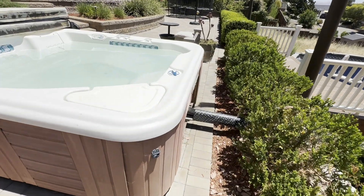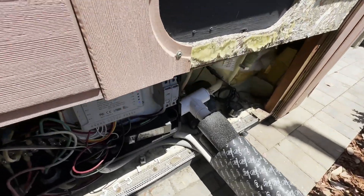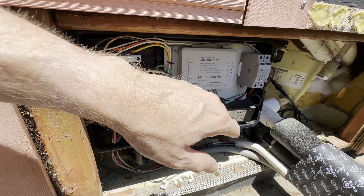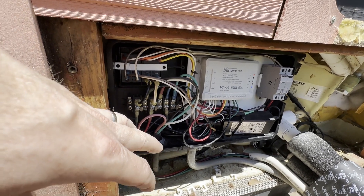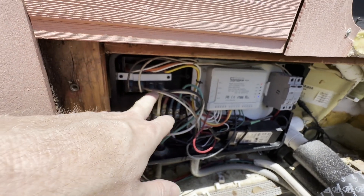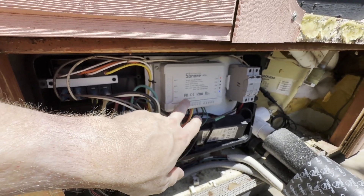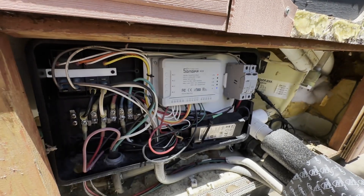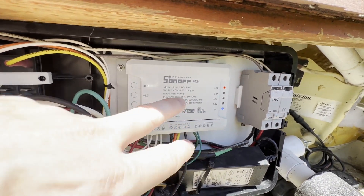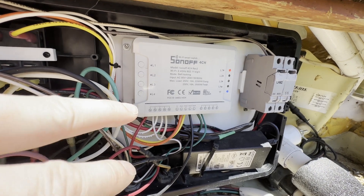In California I wanted to conserve energy because energy prices are high. Let me show you the mechanicals. I've got the cover off — this is the original control box, but what I did was gut it. The Hot Springs control box had relays in it; I bought replacement relays for controlling the heat and the main pump. Same relays fit in the same spot, but I got one of these Sonoff four-output controllers over Wi-Fi. You use the Sonoff app on your phone to control four circuits: circuit one is the recirculation pump for heat running all the time, circuit two is the heater, circuit three is the jet pump, and circuit four is the lights.